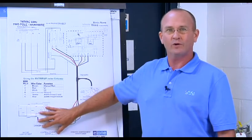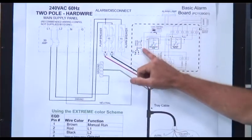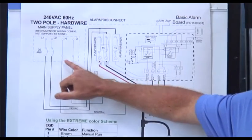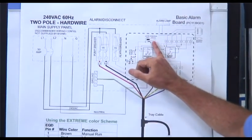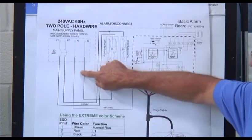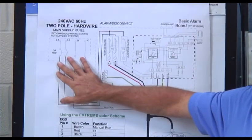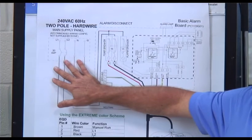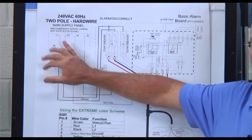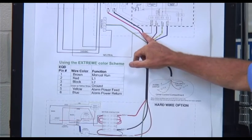Because we're doing 240 volts, you need two different legs of 120 volts coming in from your source. The alarm circuits are rated for 120 volts plus or minus 10%, giving an operating range of 108 to 132 volts, so we need one leg of 120 volts with a neutral wire. There's also a ground wire coming from the source tied to the ground bus inside the alarm panel — so we have four wires coming in total, and it's extremely important that all four are present. We're recommending 30-amp dedicated service for supply power to the entire system.